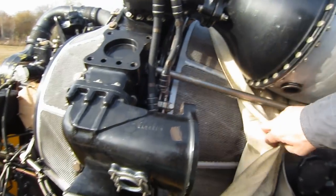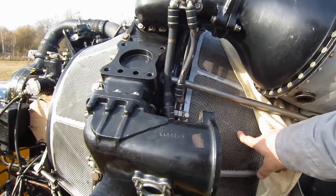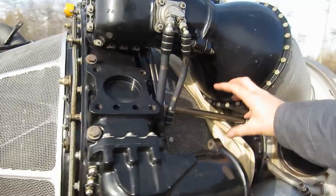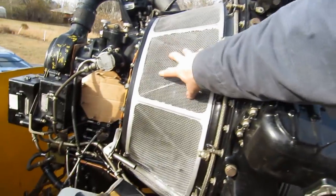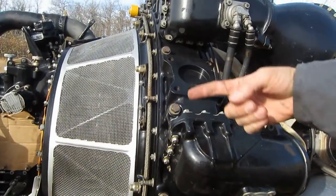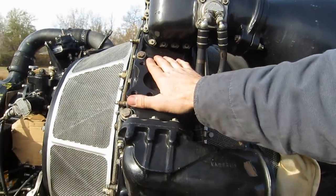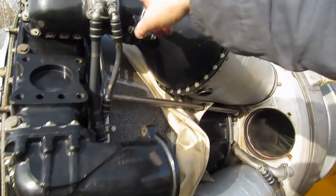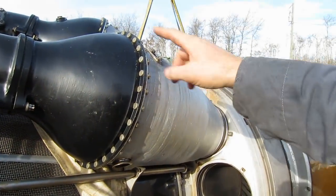There's one side of the giant impeller, and here's another side. The compressor takes air from here and there and flings it centrifugally into this case — this is the diffuser case. And the air turns a 90-degree corner into each individual combustor.